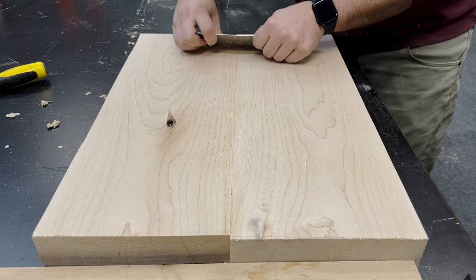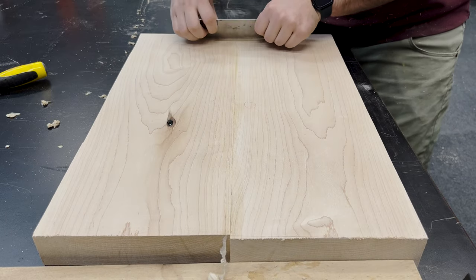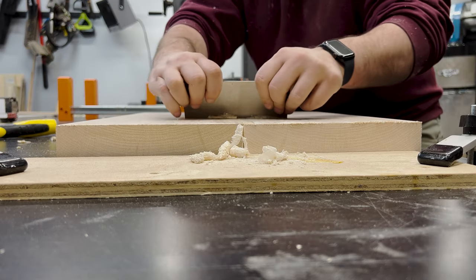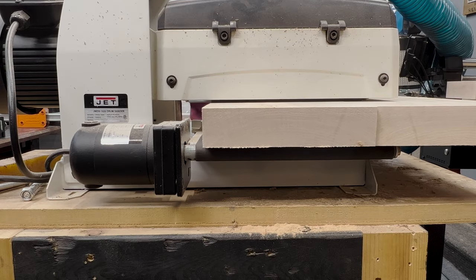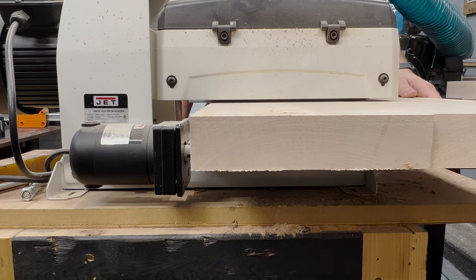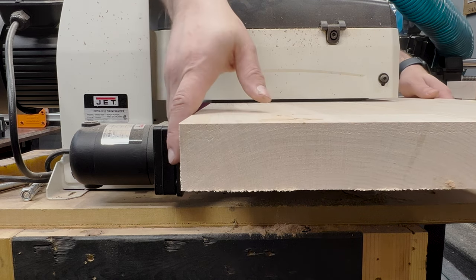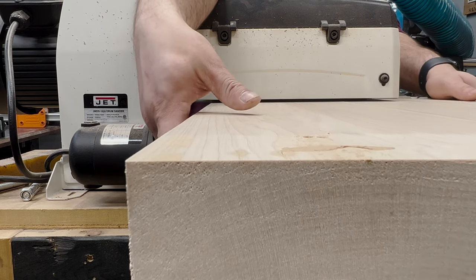And unless you have some secret method you use for glue-ups, you'll likely have a little seepage from the mating surfaces. We used a cabinet scraper. It can remove insanely fine layers to make those joints, edges, and curves absolutely perfect. If you use a destructive method of glue removal like most of us do, you're going to want to make sure your surfaces are level.